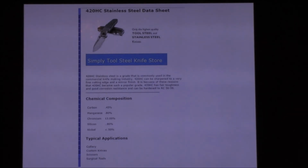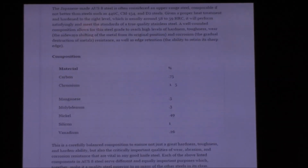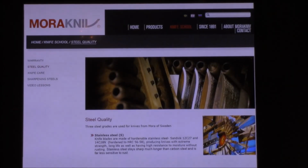Wilson traditional blades use 1075 carbon steel, which is missing all these valuable components. The cost of the traditional metal is 89 cents a pound. That is less than 1/10 of the price of the 440C. Jackson Matrix uses AUS, a Japanese grade comparable to the 420HC. Rydell blades do not list the types of steel used, only that they are made in Sweden. We only found 2 companies that produce this type of stainless steel.